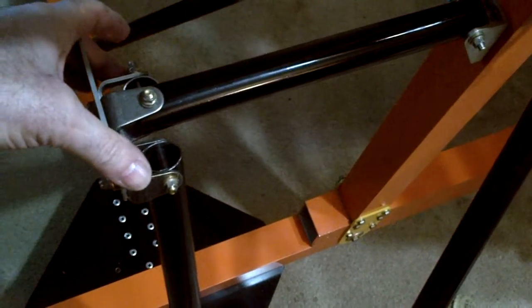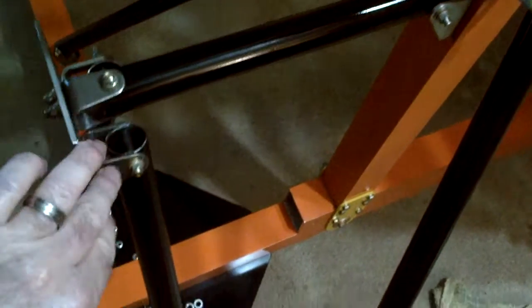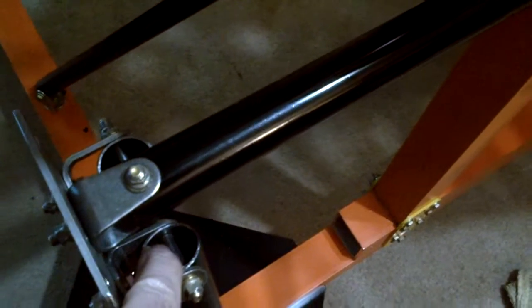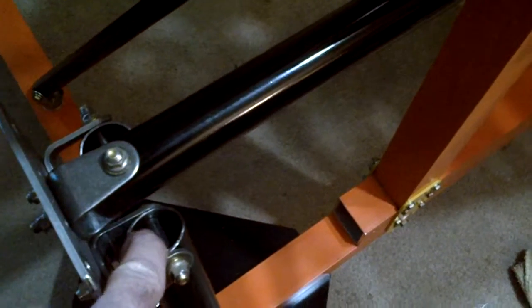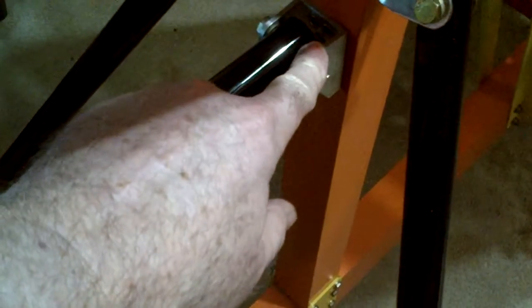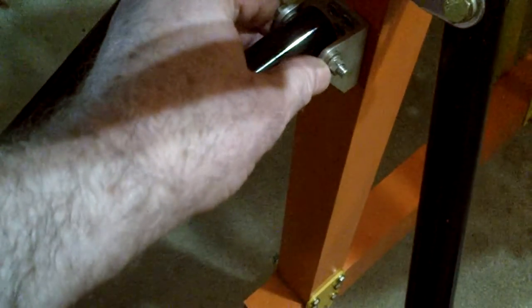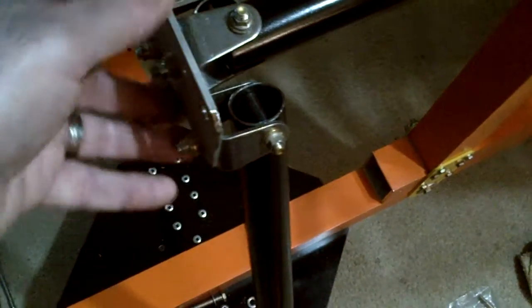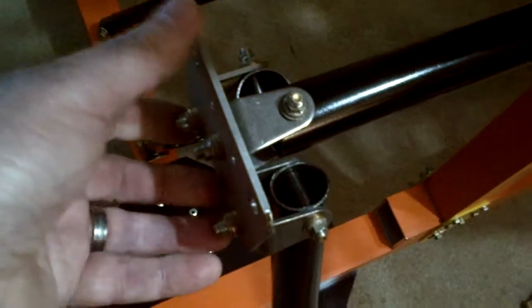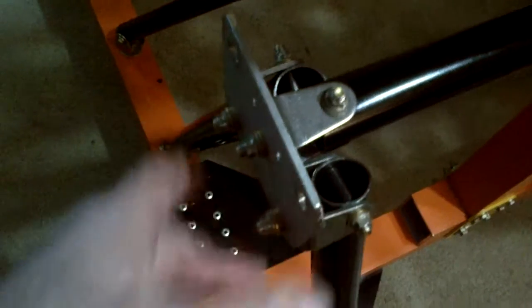But these straps have all been changed, and it's all stainless steel now, heavier. I have inserts to keep from collapsing the tubing. It's 5/8 by .028, I think, was the tubing that I used, and that's in the end of each one of these tubes, which I painted today. Decided to keep that one since I did such a good job of riveting it in, and I got some proper length bolts in, so this thing is solid as it can be now, and it's nice and level.